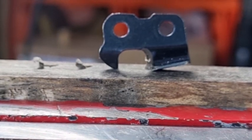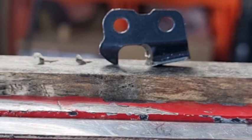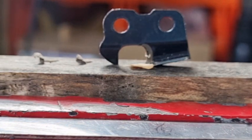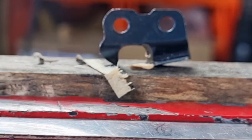One thing that's interesting is that chips in hardwood and softwood are different — the chips are much bigger in softwood. I found them a little bigger; I'm not going to put a figure on it. Here's one little tiny chip, and here's a longer chip — look at the length of that one. That was out of a three-eighths chain that was on pine timber.